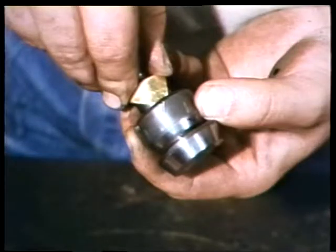During spotting in, the disc must not be allowed to rotate. To keep it from rotating, use a piece of shim stock. Another method is to put the shim stock between the disc and stem.